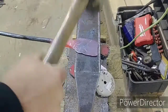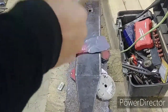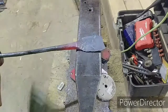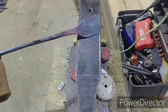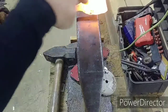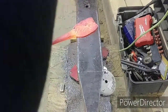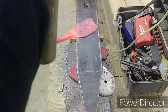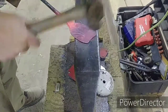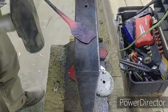It's so amazing — when it gets to a lower heat you give it lighter taps and it really starts taking some of that stuff out of it. I also know I don't want to work it too cold. Getting pretty thin there. I'm getting the bevel like I wanted it by flipping it up and down and holding it at the angle on the bevel of my handle. I'm scared to death that this has got a crack on me, but there's still some girth in the middle. I know I need to work on hammer control.